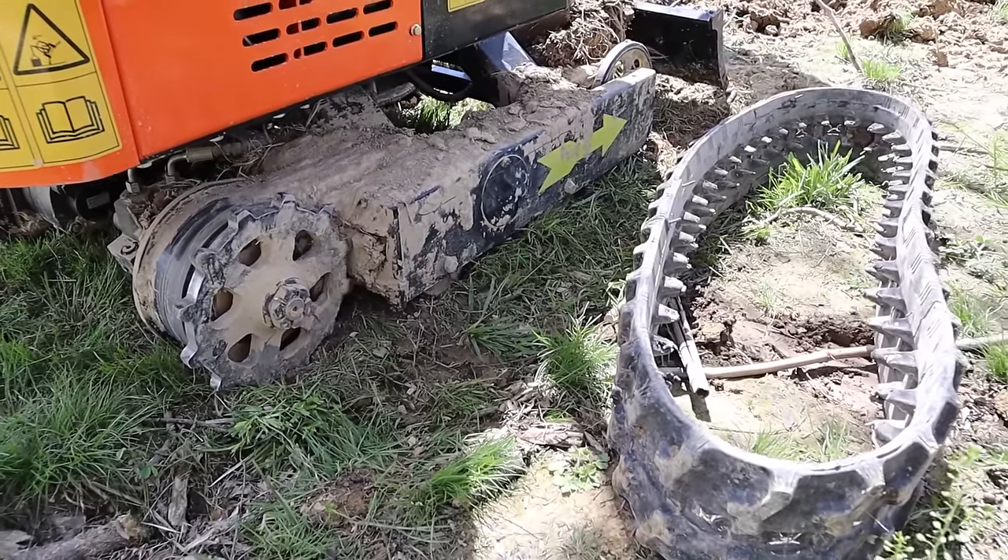I found the purpose of today's video — to show you guys how to put the track back onto your mini excavator. Ours just popped off for no clear reason. We were just moving back and forth straight while digging a trench, but the track is completely off. What I'm going to do is position the machine so we can put the track back on. First, start it up, move the boom arm perpendicular to the missing track, push it down to pick the machine up at an angle, and tilt it to allow easier access to the bottom and get the weight off those wheels.